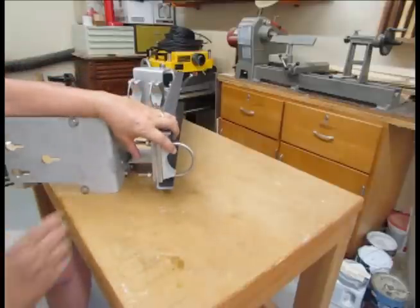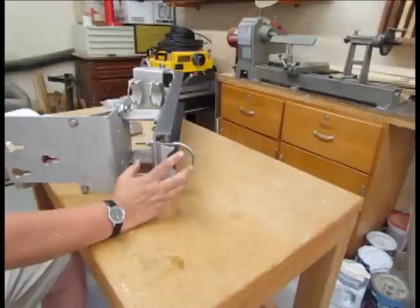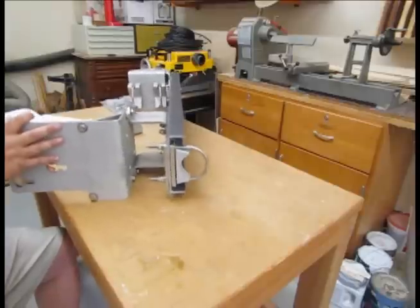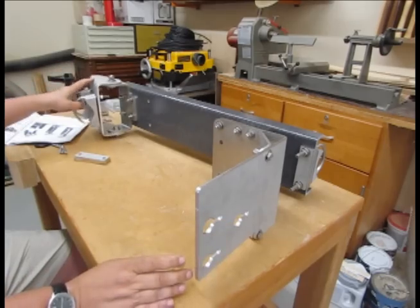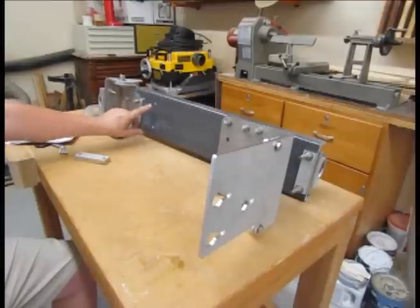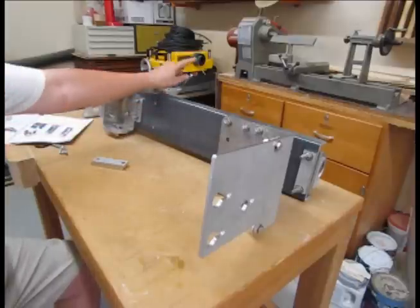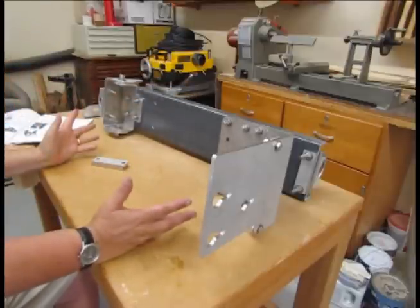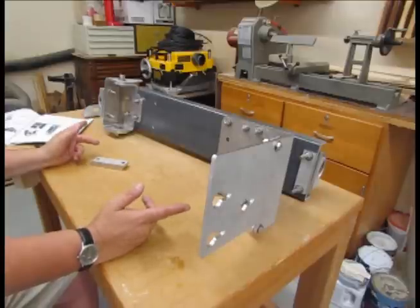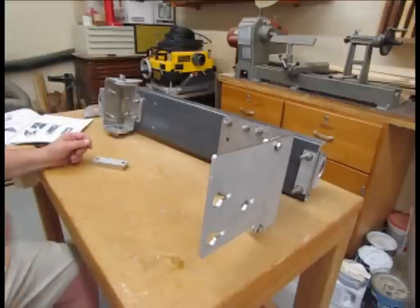This is going to be the clamp that holds the top of the first section of the vertical antenna. Another one of these clamps is located further down, right above the hinge. This is the mast side, and the antenna side is over here. We'll install that U-bolt and then this assembly will be complete — just ready to tighten down, apply the anti-seize, tighten down the hardware, and mount right on the mast. We'll be ready to do some more assembly as soon as we get out to the site where the mast is.